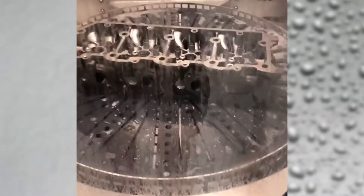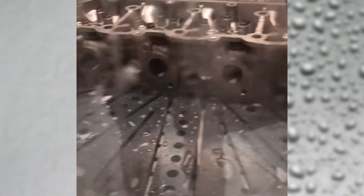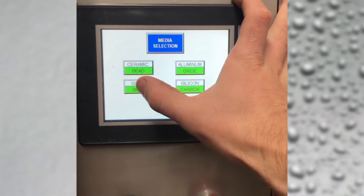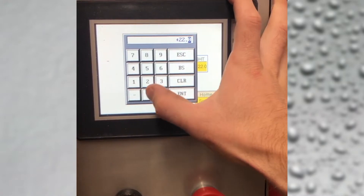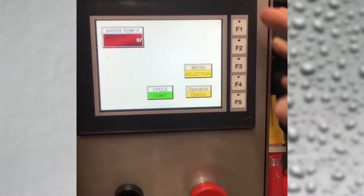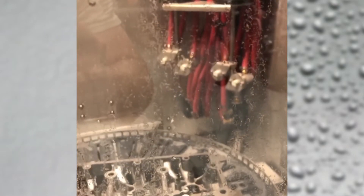We've laid the cylinder head down on the turntable. The first cycle is 20 minutes. We're going to try to get some different angles on the part, so we're programming it again — selecting the abrasive, the abrasive size, and the height of the part. You can see how quick this is to change, and then cycle start. The guns are going to travel down and then it's going to start — we can't see after that.